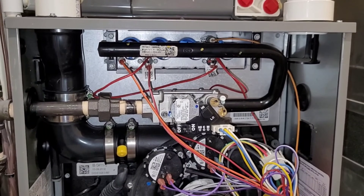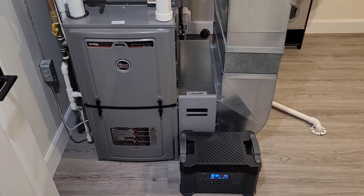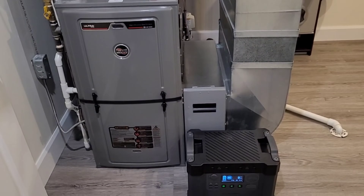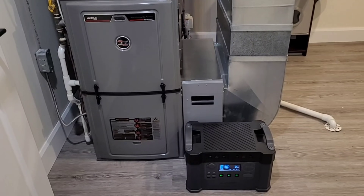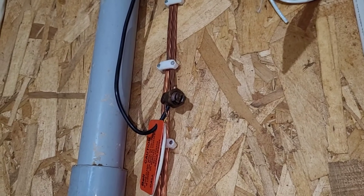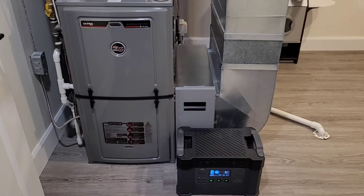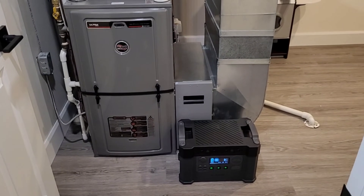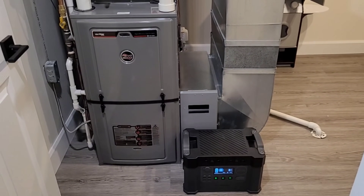This method should work for most modern furnaces — obviously your cord is going to look a little bit different depending on how you have to connect to it. You could use spade terminals and go straight to the circuit board. If you have a gas generator, most gas generators do have a grounding lug — you would run a piece of grounding wire from that lug to your home's main ground. As long as you ground your neutral and your ground plug at the generator, you should just be able to run your furnace on a normal extension cord. If the power is out and your house is freezing, it's something I would try. Thanks for watching and I'll see you in the next one.